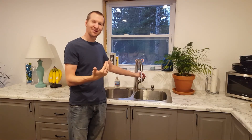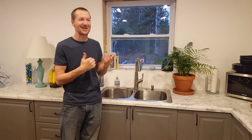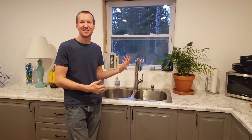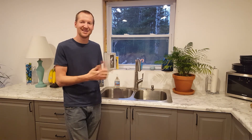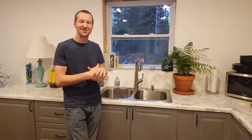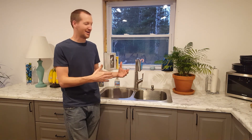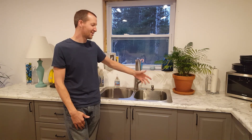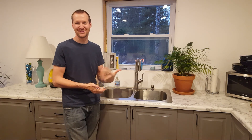So here's the final project. I think it works like it should — hot and cold water, pretty basic. This is a very DIY friendly project and I think almost anyone could do it if you have a few basic tools. It gets a little bit more complicated when you're doing brand new plumbing with cutting the copper and that kind of stuff. I used a different kind of trap — that accordion style which is really easy to use, though I'm not sure if it's going to clog over time, so I might have to go back and switch that out. The luxury I had is these are brand new countertops, so at the factory they cut out the exact size for the sink I had. If they didn't do that, you'd have to use a cardboard template that comes with the sink and cut around the template. If you have any questions, leave those in the comment section down below. And as always, please subscribe. Thanks.